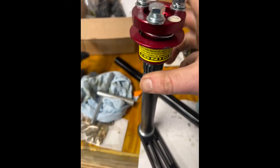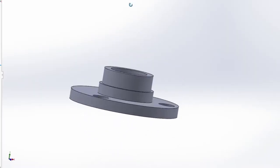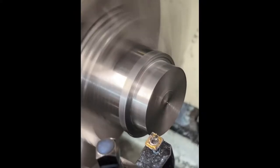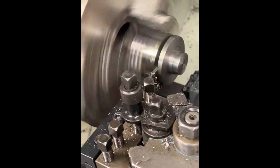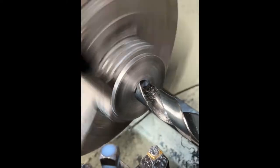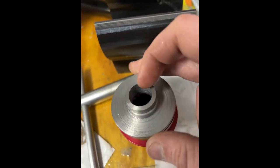Now the upper piece fits onto the spline, but we need to create a flange piece to help mount the upper steering column. This tube will be made out of alloy steel. Here I am turning down a couple different diameters, then go ahead and part it out using a parting blade, flip it around, face the back side, drill it out with a small drill bit, and drill it out with the big drill bit. That looks good, but it needs some mounting holes for screws.